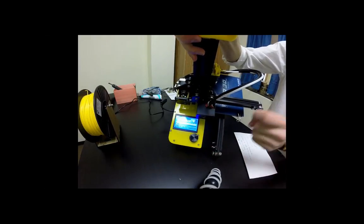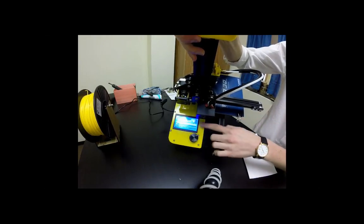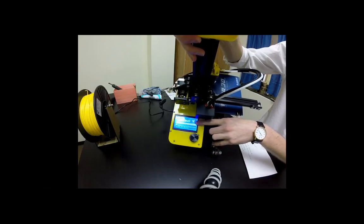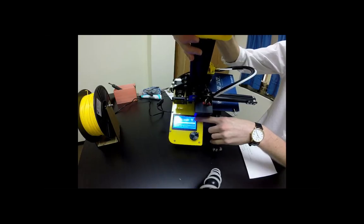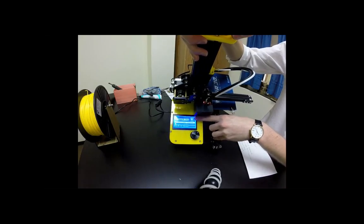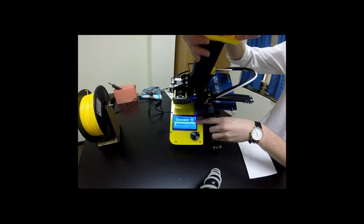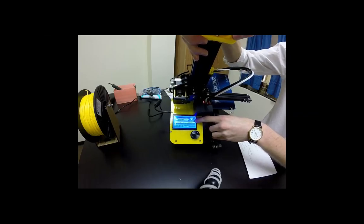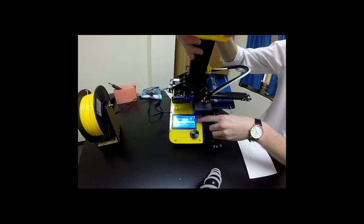So it should be back into this position with a heated nozzle. If you look at that display screen at the very first screen, it's going to have two values on the nozzle. The top one is what it wants to heat to, and the bottom one is what it currently is at. Mine says zero. I'm at 221. Is that 220 now? Yeah, it's going to cycle back and forth as it turns on and off the heating block. No problem. Cool.